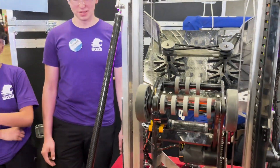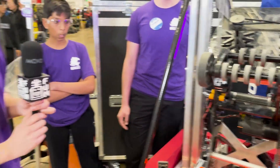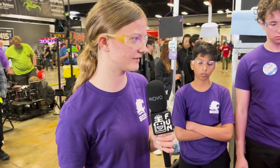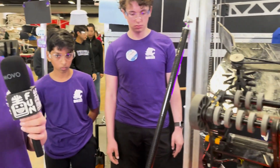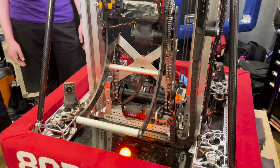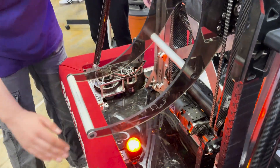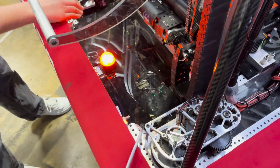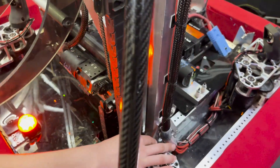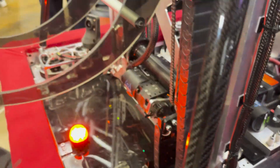So what does the design synthesis process look like? What are you guys doing to make sure this all integrates very well? First we have individual subsystem CADs, then we integrate into the full robot and make adjustments based on which subsystems interact with each other. The drivetrain has two inner support plates, and the elevator mounts on top of them with two gussets on each side, which helps with stability.